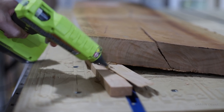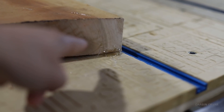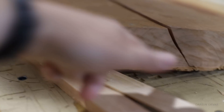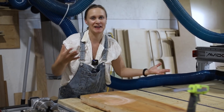The trick when you are surfacing like this is you can't put any clamps or anything above the piece because you're going to go over the whole thing. This is actually quite a small amount of hot glue right on the edge, but that's enough to hold it — it doesn't need a whole lot. If you put too much hot glue underneath, it would be annoying to get off later because you have to flip it and flatten the other side.